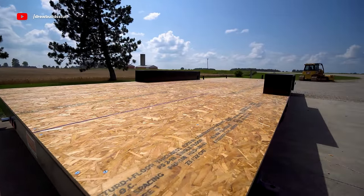And a lot of people are going to say this should be tucked in behind the house wrap, but this stuff's really sticky and expands when it gets wet, and professional roofers told me this is fine, so I guess it's fine. If you're really watching here, you'll notice that I'm actually stapling down the lower portion of this membrane.